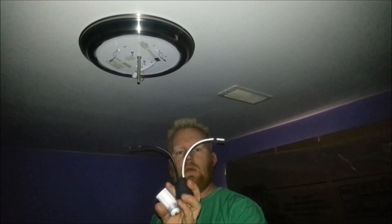Total cost: you'll need probably about — this is a splitter — so you'll need two CFL bulbs. You'll actually have more light output, but to get close to the light output you had before, you'll need a light bulb socket connector for about three bucks, and these are about two bucks. So for five bucks, you never ever have to worry about replacing the expensive circline or round fluorescent bulbs.